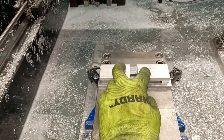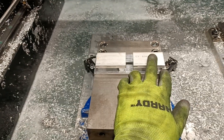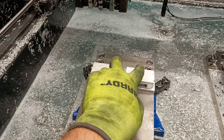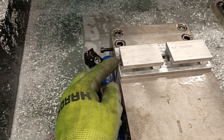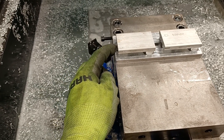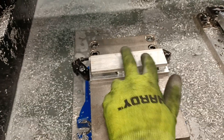And the reason I have dual offsets is because, let's say, the next time I put these jaws in here, it's tipped a thou — so this side's maybe a thou lower than this side. I can independently adjust anything about this because they both have their own offset. So if I wanted to make the G55 a thou lower or a thou higher, I can do that. I still only have to touch off one spot to begin with — I touch off G54 and then I go to G54 and zero out G54 and G55. So I'm not setting up everything twice. It's the same offset; I just have them programmed as dual offsets so they're independently adjustable.